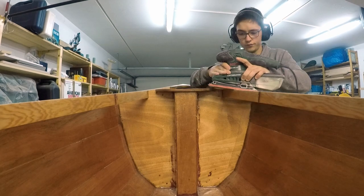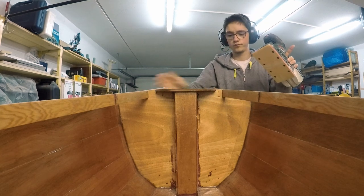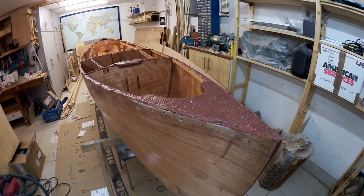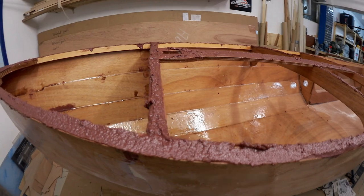And again a little bit of sanding. So after sanding the boat again, and this time the deck as well, and getting over my frustration, the next morning I put on a little bit more epoxy this time so the deck could mate with the boat's surface everywhere, and glued the deck on again.